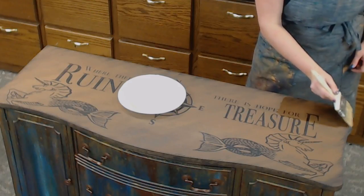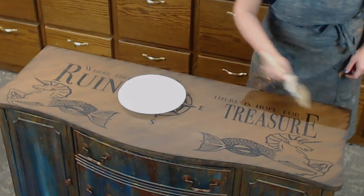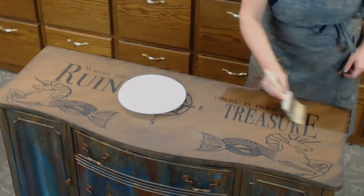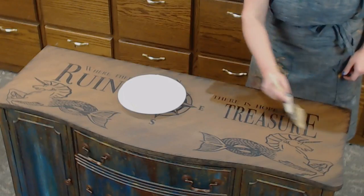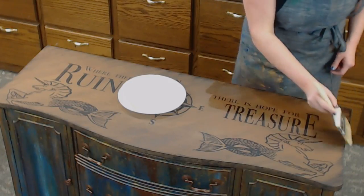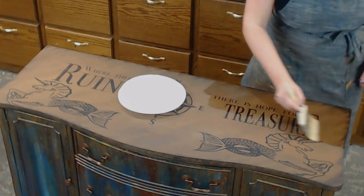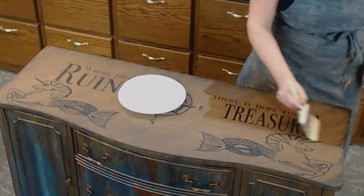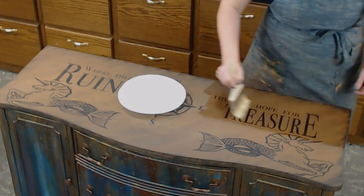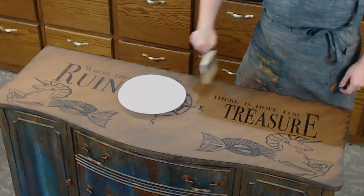Everybody loves Famowood. This product here I'm just putting on with, this is different than tung oil finish or tung oil. Now, regular tung oil, you would put that on and then wipe it off. Put it on and then wipe it off. This has like a polyurethane kind of feel to it. But I noticed that it's less likely to bubble, but you still don't want to put it on all super thick.